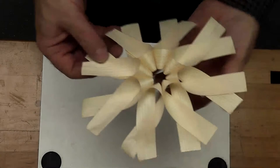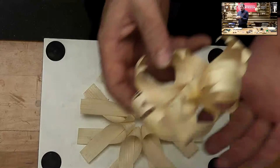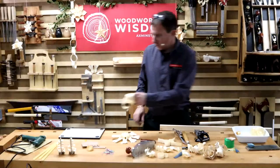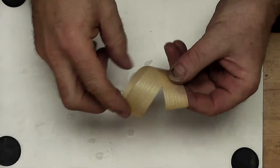Just a quick guide so I can see where the glue's got to go, especially with hot melt glue. You've got a little bit of open time so you can move it. Just a quick look — we need four of these. I'll draw a line down through again, nice and light. Pin that in, not too much glue. Best way I've found to get rid of a spot of glue — a little six-inch ruler, or a square. Don't use anything sharp if you've got a spot of glue on it. You can tap it off with something square-ended. Definitely don't go with a chisel because it will cut through.